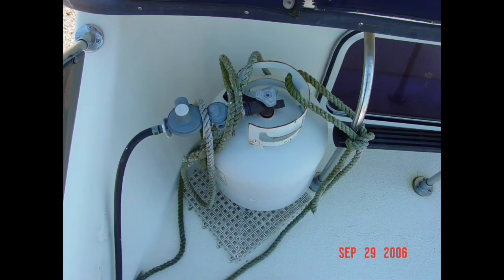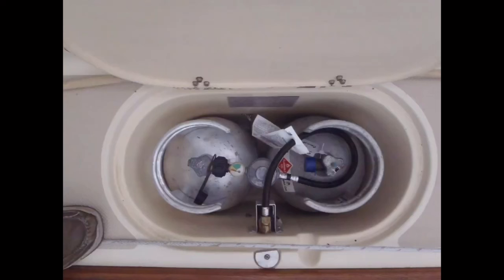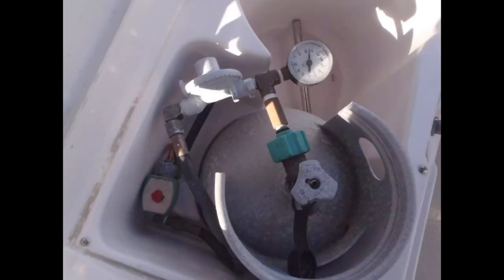The LPG system installation here — and I do use the word installation loosely — fails to meet many industry standards and recommendations regarding LPG system installations. The two we're going to address with regards to this photo would be an improperly secured propane tank or storage tank, and lack of a pressure gauge. Propane tanks must be installed in a dedicated propane locker that is vapor proof to the vessel's interior and vents overboard, or be located on the vessel's exterior so that escaping gases can flow directly overboard. The other requirement is the LPG gauge, which allows you to conduct a leak down test to verify there are no leaks in the system.